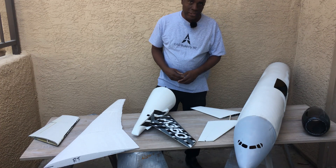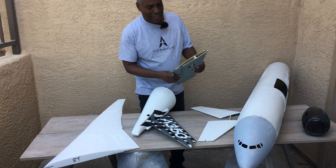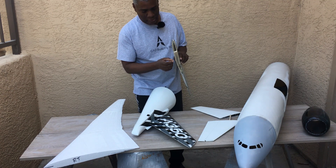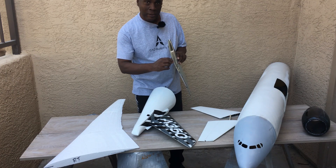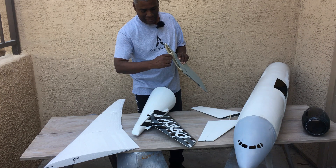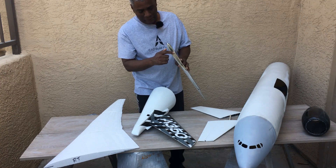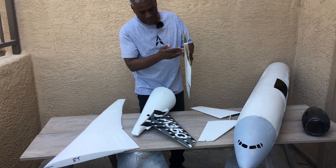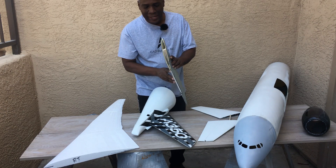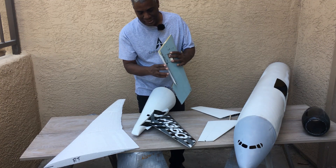To help you understand what TABS actually is, I cut up one of the wings to show you what it looks like inside. We have the outside shell, which is the fiberglass, then we have the foam on that, and then another layer of fiberglass on top of that. The other side is done the same way. Then we just have a light strip structure that goes down the middle — and that's what it is. I also went ahead and cut the flap, and there's the hinge.